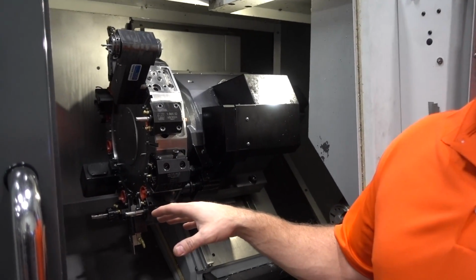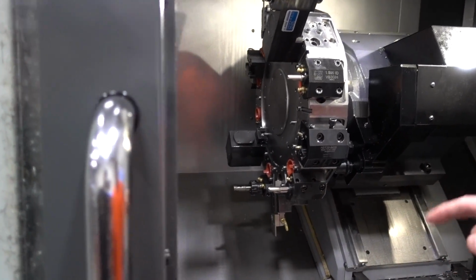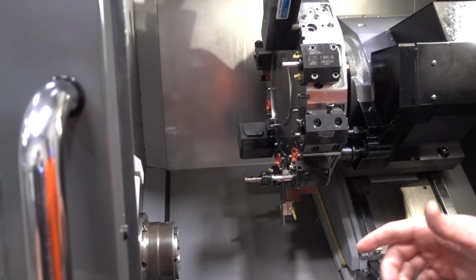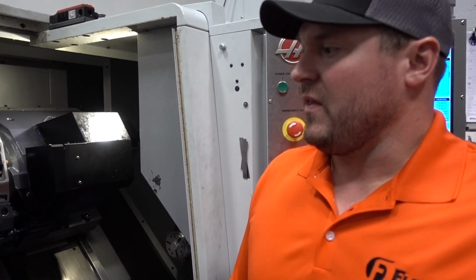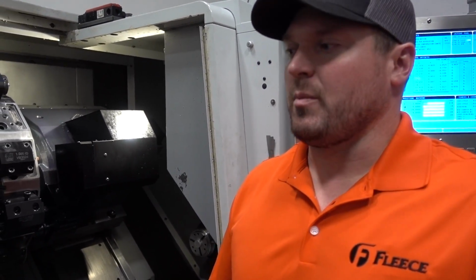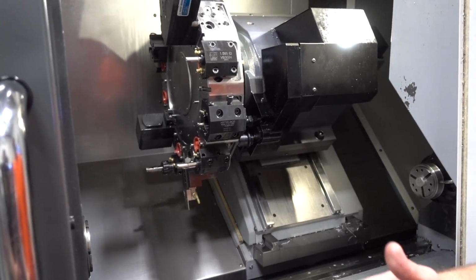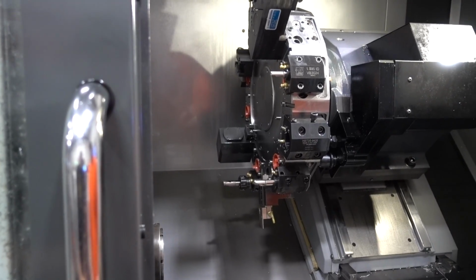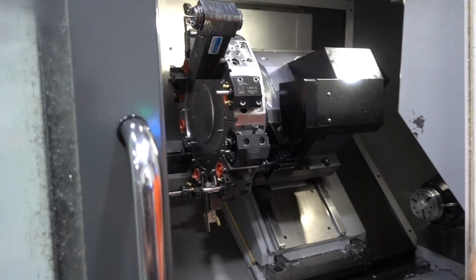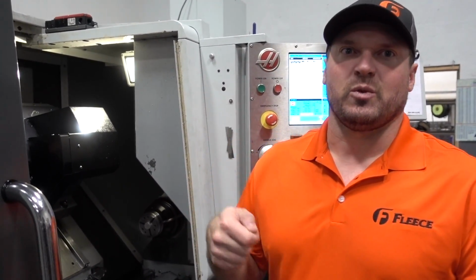We bought this machine to make our camshafts. We can make a camshaft in 8 minutes before heat treat, all operations finished. CP3 cams. Then those go out to be heat treated, they come back, we load them up, and then they get hard turned. That hard turning process uses a polycrystalline diamond PCD insert, and it's just fire coming off the tip. That's 60 Rockwell, which is crazy. You can't touch them with a file.